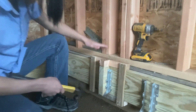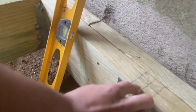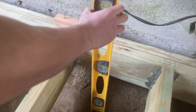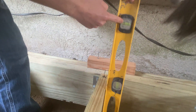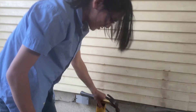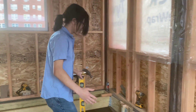The problem with this contraption is that my dad has used it for his previous joist hanger jobs, and if we take a look at them, some are okay, but you'll notice some are not flush — these are definitely not flush. The problem is that execution really depends on how perfect your contraption is. In our case, the contraption was not that perfect, which left the joist actually crooked. You can see on the level that the bubble is not in the center, even though it's aligned with the side of the joist, indicating the contraption itself was crooked. So we have to find a different way to secure the joist hanger, making sure the tops are flush with the beams and not crooked.